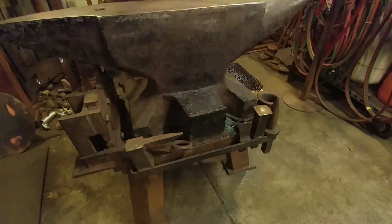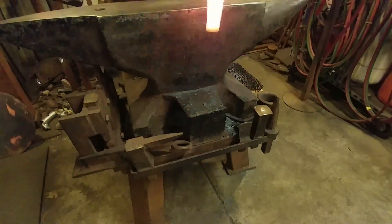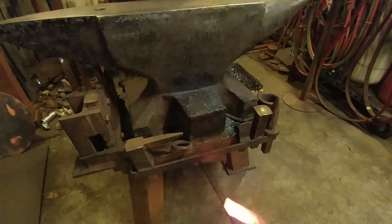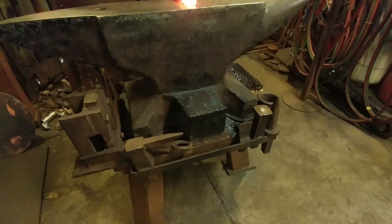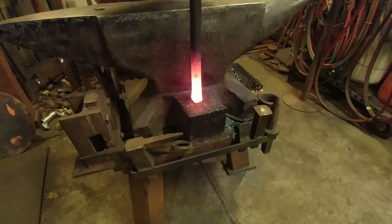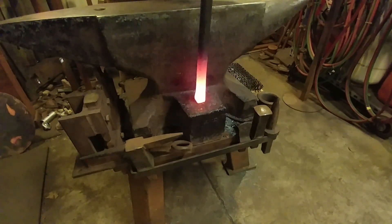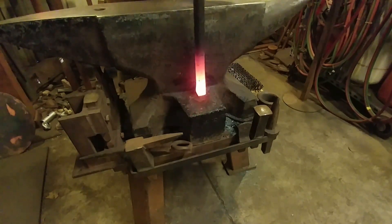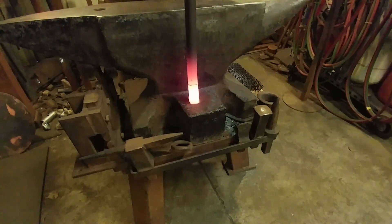As you can see, there are really two different ways of upsetting. You can use it where you're hand hammering the piece, or you can use the piece itself on the upset block to upset it — especially if this is a longer piece, this is the way to go. I've found this upset block to be quite handy in my shop. This is really the first time I've used it quite a bit, but it was able to keep the piece fairly even and straight.